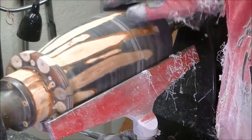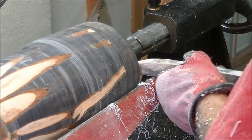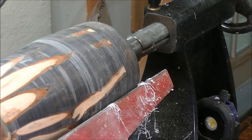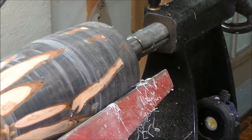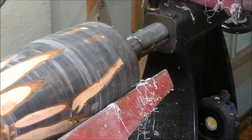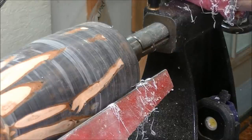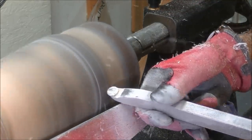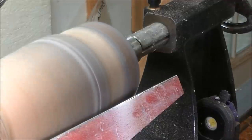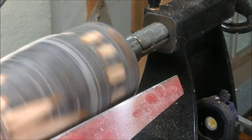Let's work on this end for a little while. I've got the right knife on this thing. That's my walnut right there, so I'm going to basically do the same thing here and come up to that point. Then I've got to figure out how to square the bottom off and put either a tenon or a recess — I'm prone to go with a tenon with walnut. Walnut's bad about splitting. It's popping me like a big dog. Look at that chipped chip — what's going on there?